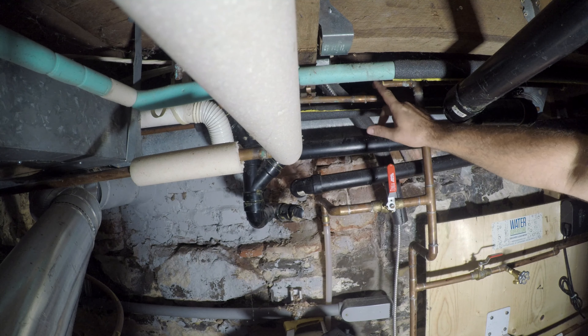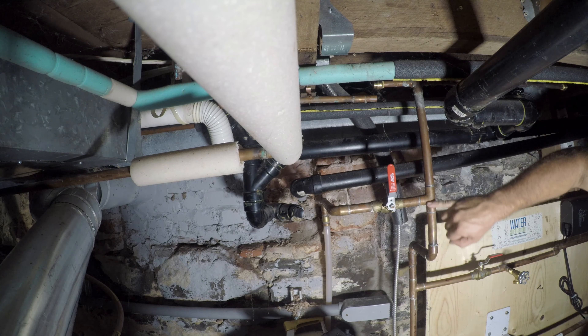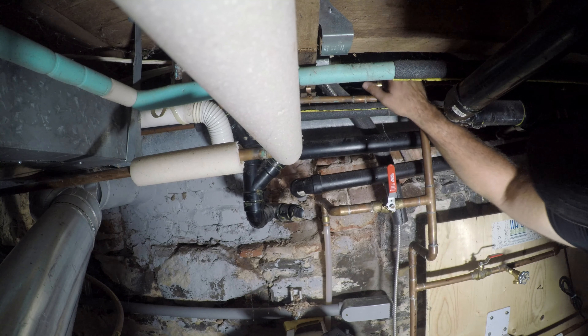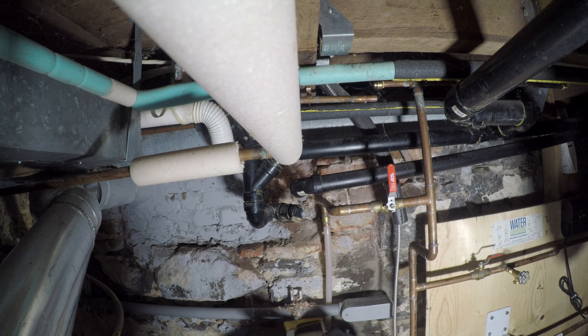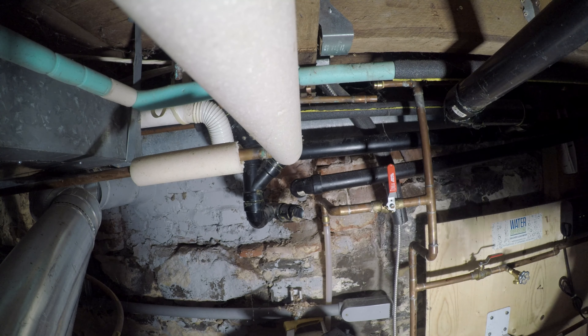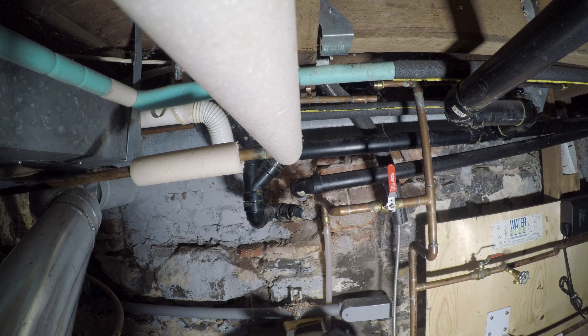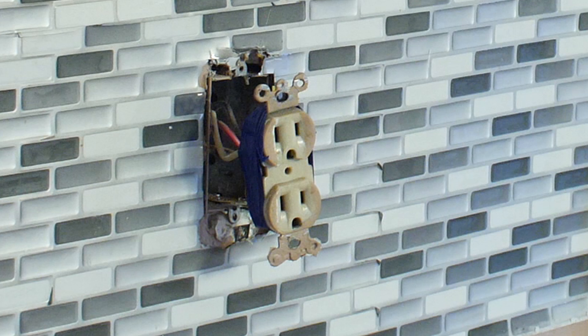I got my other half-inch cold water line capped, so theoretically when I turn it back on I can get the loft going again — water will come up and stop here and here. The plumbers can come in and change this during the reno, but that's okay. I'm going to go ahead and turn the water back on, keep that closed, pressurize it — no leaks! Those are way too easy. First thing for demo: shut the power off, remove all the plugs and switches, tape them up with three or four wraps of tape, then you can turn the power back on if you need it and start the demo process.